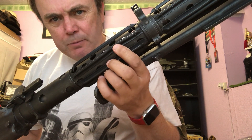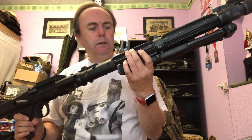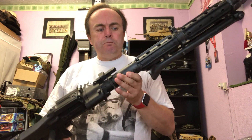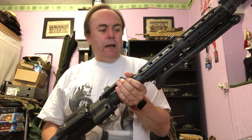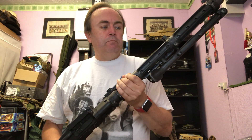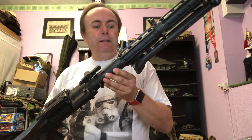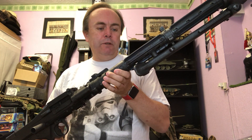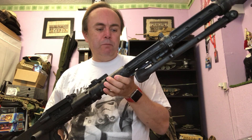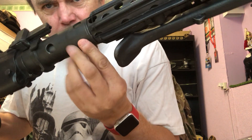The next addition: the t-track has all been replaced with rubber t-track — you can see it's moving. This rubber t-track would have been on the originals. In order to do that, I had to strip off the original hard plastic t-track, which meant stripping the barrel shroud back to bare metal and repainting it. That was a bit of a pain, but I think it's been worth doing.